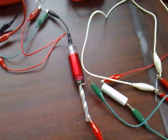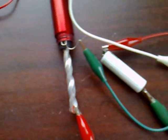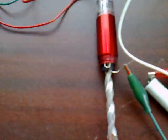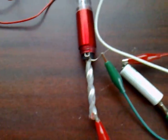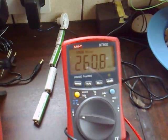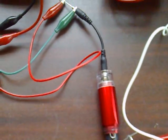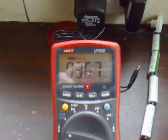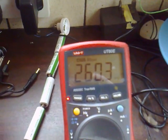The first experiment I want to show you today involves this 1.5 volt mobile phone charger. I've extended the battery so it's actually outside of the charger — I've put a piece of rubber pipe up it and moved the connections outside. I'm running the 1.5 volt battery through a 1 ohm resistor, and this meter here is measuring the current draw at 260 milliamps. The output from the phone charger goes through another 1 ohm resistor and that meter is reading 37 milliamps, so we've got 5.5 volts coming out at 37 milliamps and 1.5 volts going in at 260 milliamps.